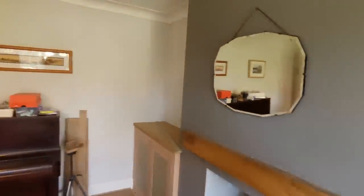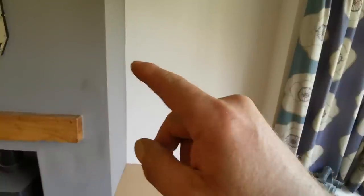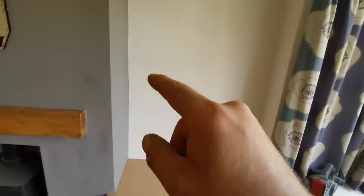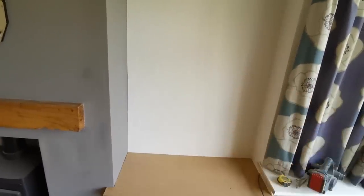Shelves now. There's different ways of making these. I could put a batten around like that, put a straight edge across, and work out the distances if that back was bowed. Or I could just put a batten around, put a bottom board in, lay some timbers around and fix the front batten. But these are pretty straight, so I'm going to make a three-legged piece with these battens already fixed on, screw it in place, then fix the front one.